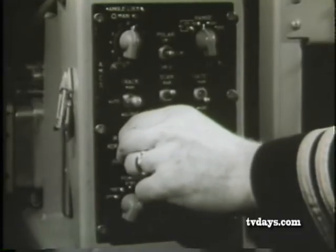Reduce gain. Point the antenna at the source of the noise signal. Move the antenna back and forth in azimuth to obtain the strongest signal. Then in elevation, and acquire an AOJ lock. Estimate range for missile firing by GCI information, and continue watching for burn-through. It may occur even in the AOJ mode of operation.